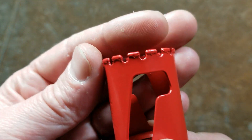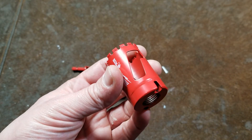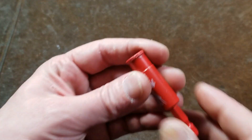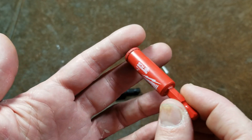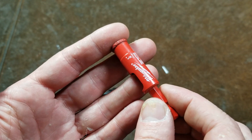One of the biggest issues is it's diamond grit, so it's not removing very big chips and it takes a long time — but it's not too bad. A little bit like this with a good water spray bottle outside, you could drill through a wine bottle to make a mobile or something like that, probably in just a minute or two.